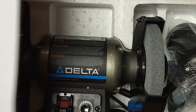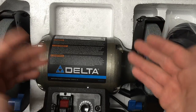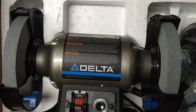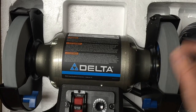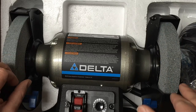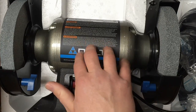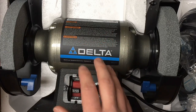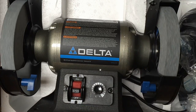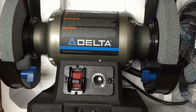The tools just keep getting bigger and bigger. I think this is the last one for now. What this is — a Delta eight-inch disc bench grinder. Just look at how high quality it is — it just spins and spins and spins, the bearings in there are real high quality. The reason I got the eight-inch instead of six-inch is because the six-inch models were actually bogging down once you started putting something in to grind or clean with the wire wheel. I did not want to deal with that, so this one has a huge motor, weighs a lot, and should handle just about anything.